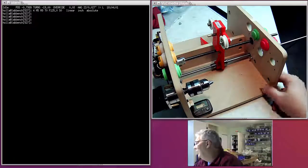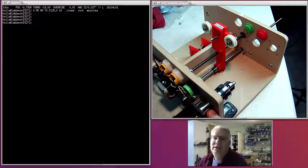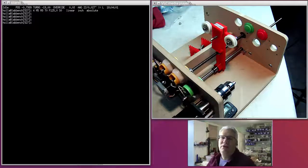That's my failsafe counter. I'm sure I could use an indexer and have GRBL tell me how many rotations, but I went ahead and put this on as a failsafe so that if all else fails I at least know where I am when I'm winding my spool. Now, this geared motor is advertised as a 5.18:1 gear ratio, but I don't think it's exactly that — when I put in the parameters in GRBL for steps per millimeter I'm off by just a hair. When you're rotating thousands of times you can get off by almost half a turn.